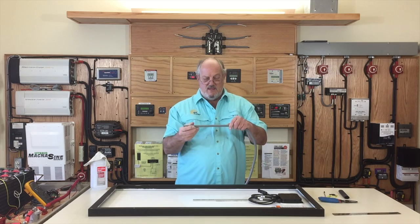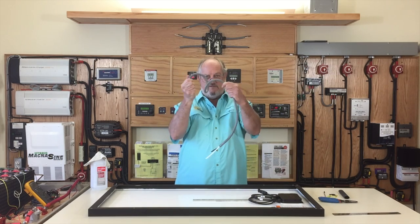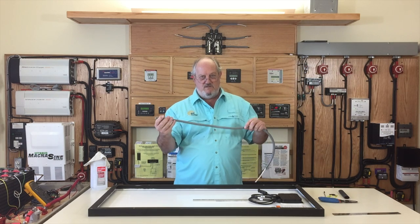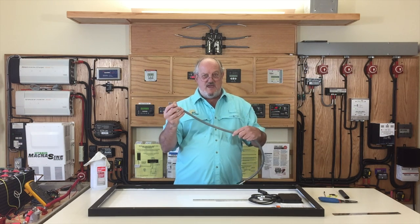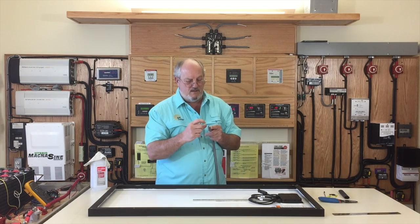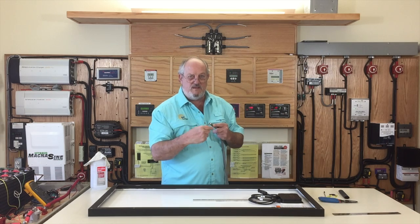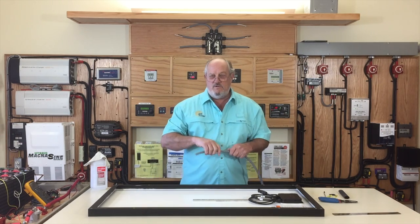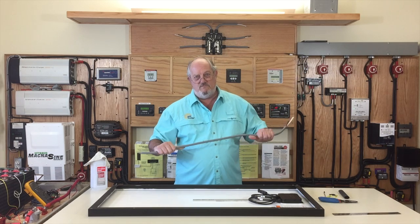We have had made a round cable that's light gray and very, very flexible. This is what we use up on the roof. It has a UV-resistant jacket, and to keep it round we have them put filler in it so it doesn't turn flat like tray cables, which is mostly what you get for roof work.